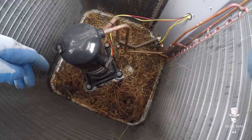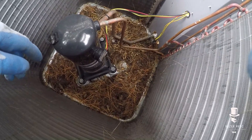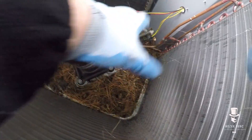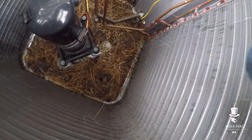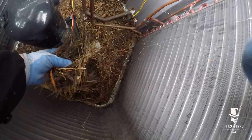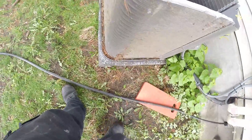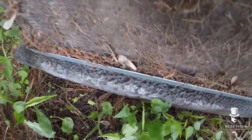Some techs will just come, take your pressures, clean the outside of the condenser — it doesn't work like that. People pay hard-earned money for our maintenance. You have drain ports in there, and when the water goes in there it needs to drain. It's not gonna drain nice when it's full of gunk. I'm gonna clean this all out — got the inside cleaned out, gonna hose her down. Looks like it hasn't been done in a while.